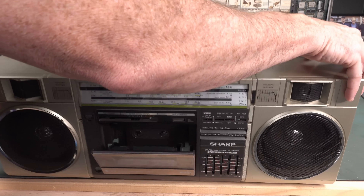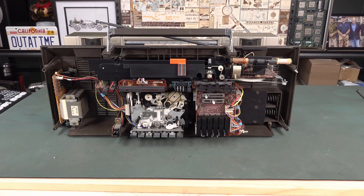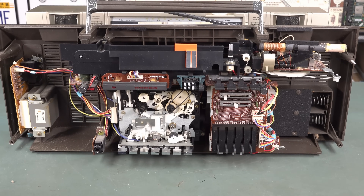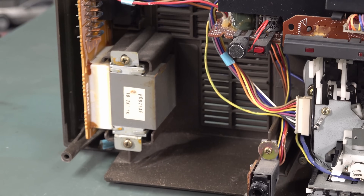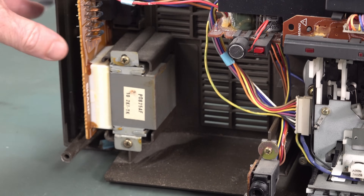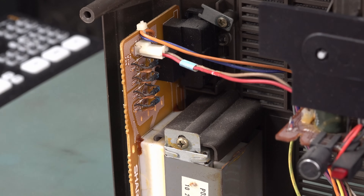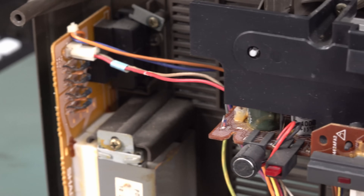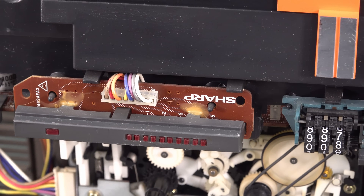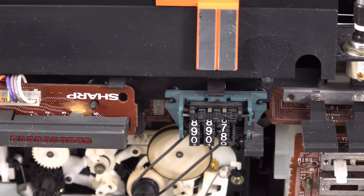Ta-da — that is inside. Look at that, thing of beauty, joy forever. Classic 1980s construction. We've got right off the bat a big transformer over here, all on its own board — very nice. We've got a discrete diode bridge here with caps to take off the edge — very nice, nice attention to detail. They've cable-tied down this wire going off here, that's pretty neat. The VU meter's got its own board there with its own wiring loom. None of that flat flex cable rubbish in here.